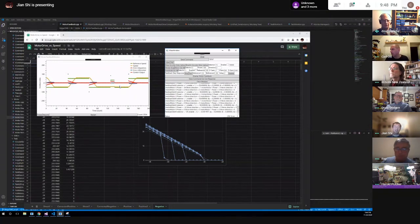So if you're just doing a speed thing, you say, I want it to go 10 centimeters or 1 centimeter per second or whatever. And the motor will take that one centimeter per second. That's your reference. Your actual speed minus your reference is going to be the error. But you can also put on top of that an input into your reference that is a position.